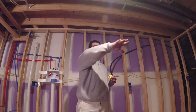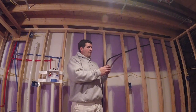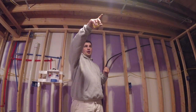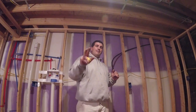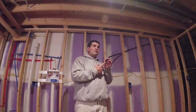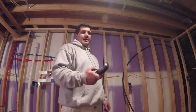This is the reason why with this particular brand you don't need to bond it to your house, even though I take the extra precaution and my electrician did the proper bonding throughout — because this is where this stuff gets dangerous. This is the only company I know of where you don't need to bond the system, but every other company I've dealt with, you had to bond it either to your water meter, from the water meter to your gas meter, or from this to your panel. If somebody put this in your house recently, make sure your system is bonded because it's susceptible to lightning strikes.